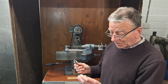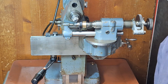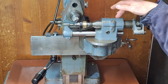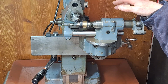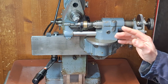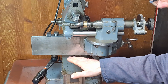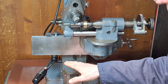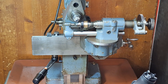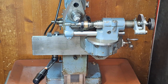I didn't want to buy a new cutter, so it's about how I achieved this. We're now ready to cut as far as I'm aware. I've set stops — that one I may have to adjust the position because I can't move the cutter through the workpiece to double check it. Everything else is set up. The working head is locked off. The work table here is locked off. I've got my safety visor ready because I don't want to be showered in the face with lots of bits of brass. So without too much further ado, we'll get on with it.